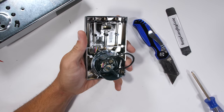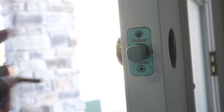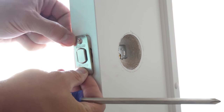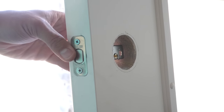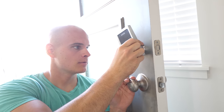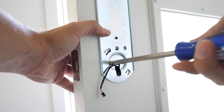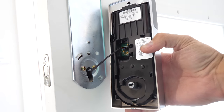Installation is pretty easy. I'll just remove the two screws holding the old unintelligent lock in place, then pull the deadbolt itself out from inside the door. The new bolt can be adjusted depending on the size of the hole — mine needs to be fully extended, and the whole thing can be screwed into the door. The front housing gets set into the door, the solid metal plate gets placed on the back, and the two beefy screws hold the two parts together. I made sure to pull the keypad display ribbon through the slot in the metal plate so I could plug it into the computer guts on the back side of the door.